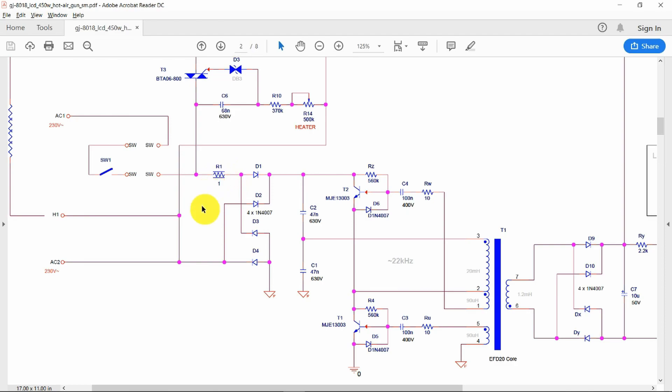Investigating further, I've checked out all these diodes — that's obviously a bridge rectifier rectifying the incoming mains voltage. I've measured at this point here and I'm getting some 312 volts, which is about right. On a good day we have 220 volts, so you multiply that by 1.414 and we get around 311 to 312 volts — I measured that, so that's fine.